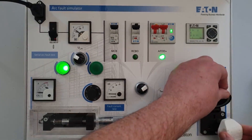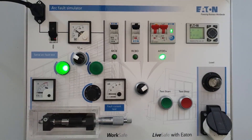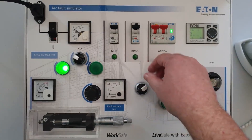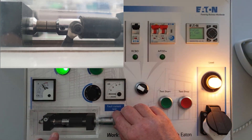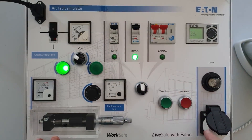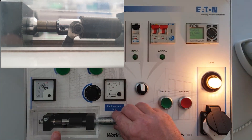The load I've got here is a domestic iron — not a powerful heater, but an iron that is up to 2 kilowatts, so it'll put a load on this. Let's go back to the MCB. If we look here, there's a much more accomplished, easier to spot arc occurring when we open this gap, but the device has not done anything. Go to the RCBO — same thing. The arc is occurring, the device is not responding at all.